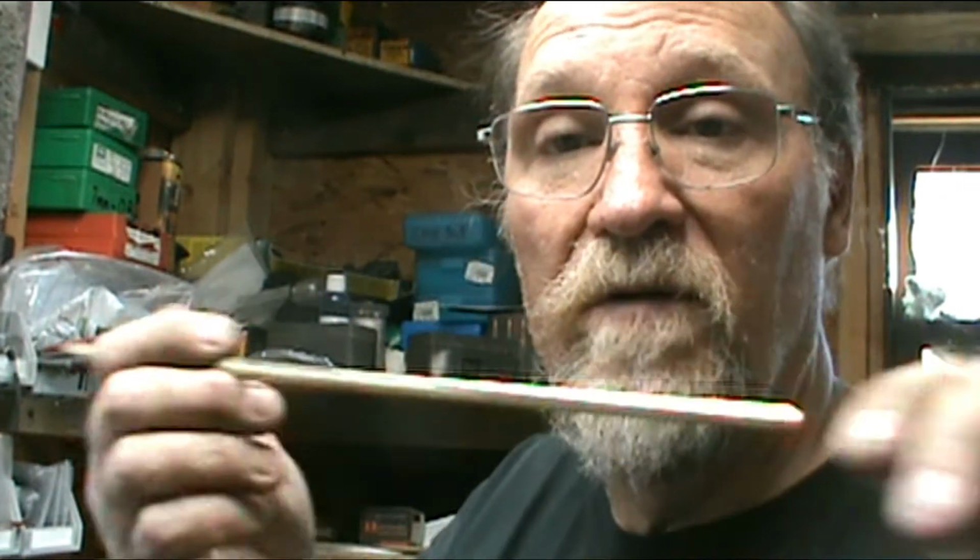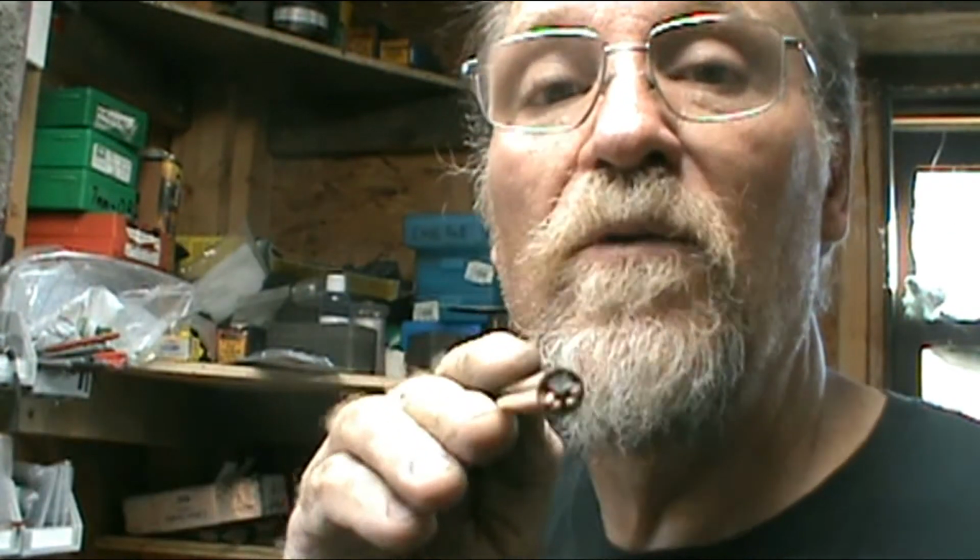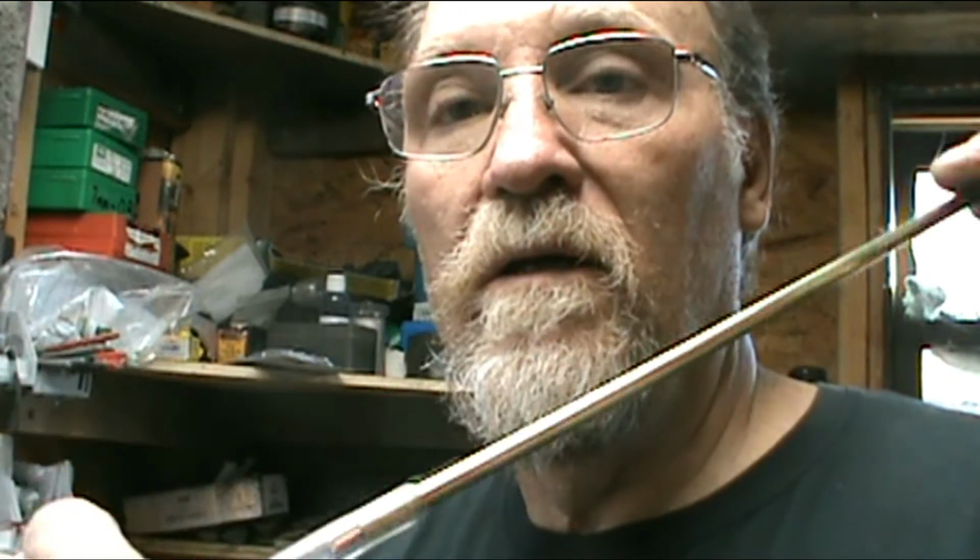Now, with this, like I said, I got this and the glue for $5. That was $3, so this was $2 for 12 inches of brass tube, 1/4 inch. And like I said, I had the wire. I've got the vacuum, yeah, got this vacuum pump here. This is 1/4 inch stuff, so I will work it right into it like this. I heated the other end of it and screwed it on the smallest fitting for that.